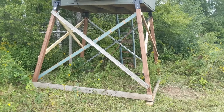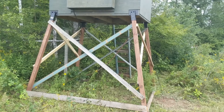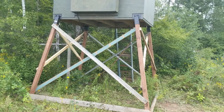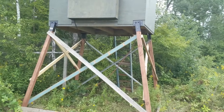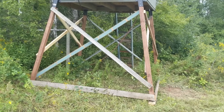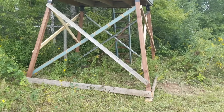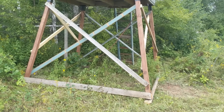I'll start with the frame. These are 8-foot brown treated 4x4s I bought at the lumberyard. I've got four elevator brackets on there. Bought them on Amazon — they have a couple different grades. I read some reviews and ended up buying some that were a little heavier gauge metal. I didn't trust those light ones. The cross members are mostly from a guy that took his deck apart and had a pile of used deck material laying on the side of the road with a free sign on it.